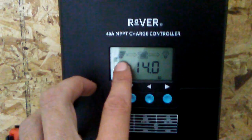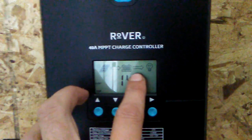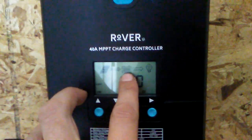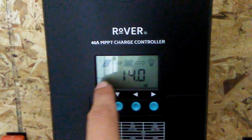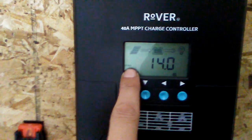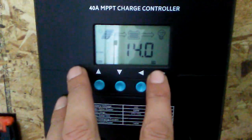The sun is on — big bright light. The panels are here going into the battery, which looks like it's fully charged, and this is going out to your load. I have the load turned off right now. It's in a floating stage, so the heat is being dissipated out the back — I cut that hole for more heat extraction. I have it set up for a 12-volt battery and it can do either 12 or 24 volt.